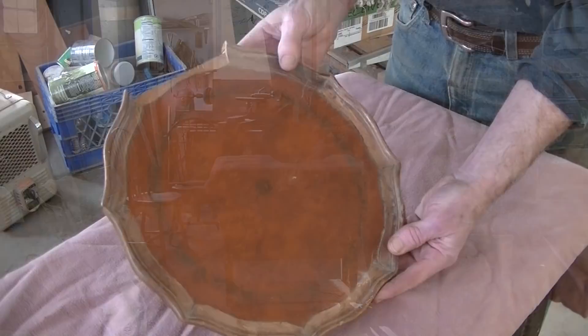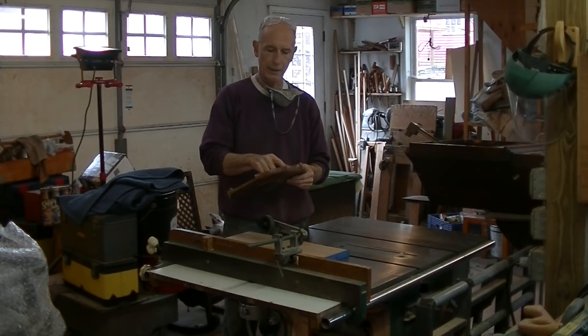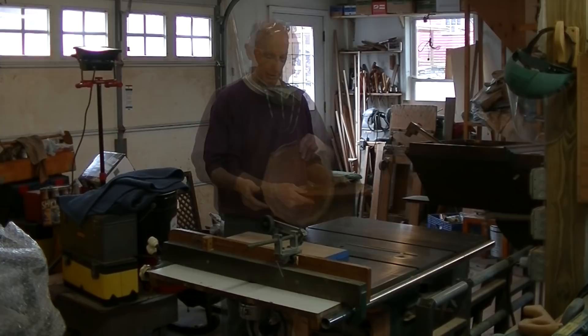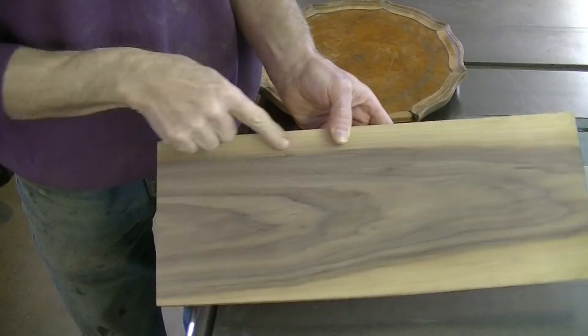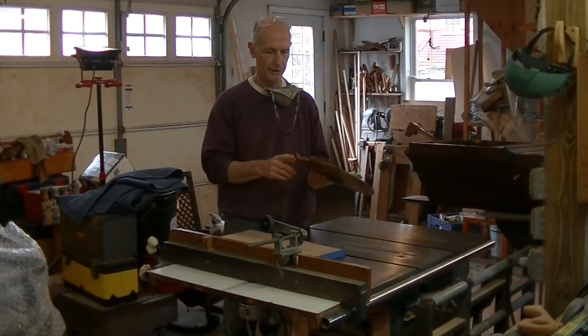This is a nice little top to a candle stand. I don't have the whole table here, I only have the top, and all I've been asked to do is reproduce this missing piece of molding. From the beginning I thought this looked like walnut to me, although it's very light, so I sanded the edge of one segment here and I believe it is walnut, but it's very light so I'm unsure. But I do have a scrap piece of walnut that has a lot of sapwood in it, and I'm going to try to use this section that will be lighter. It's just important that the wood be the same or lighter than the surrounding wood.